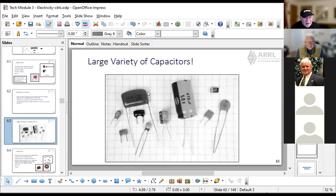I know that Mr. Marconi had a very high power radio station, and he had a large room that had a lot of glass plates. The glass was used as an insulator for the metal. And there are other types of capacitors that just use air, just metal plates with air in between. When I get home, I can show you a couple of large ones. I call them cheese slicers, actually. Okay, questions so far?